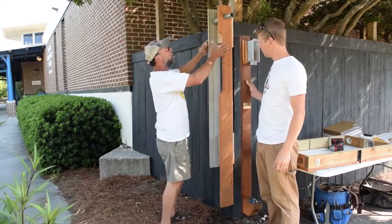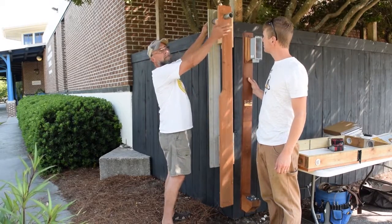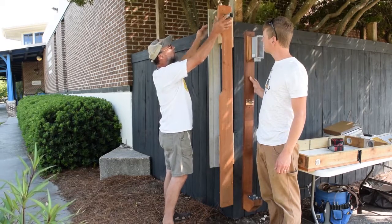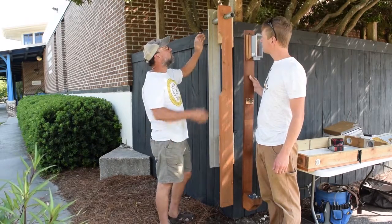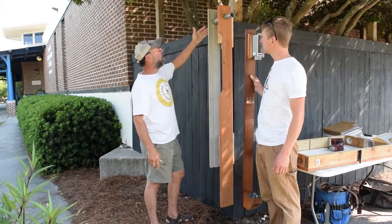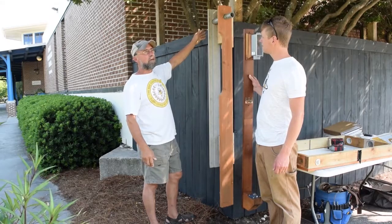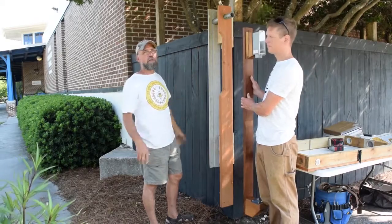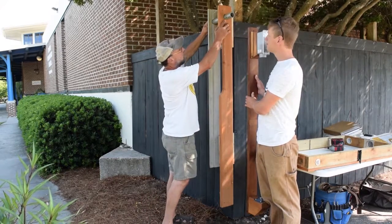Whatever your thickness is, you're going to have four inches of pipe on the interior sticking past the wall surface. On the exterior, you're going to have a half inch sticking past the exterior surface. So whatever that measurement comes out to be, that's what you want to cut your pipe. I would recommend leaving maybe an extra inch on the exterior until you get the pipe in, and then you can always cut it off. If you cut it too short initially, you're probably going to have to go get another pipe. So four inches here is critical.